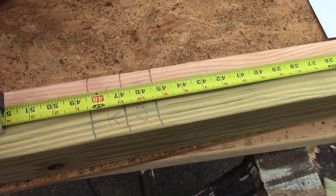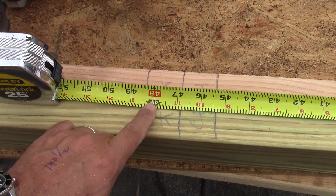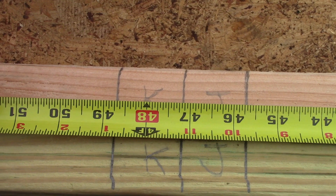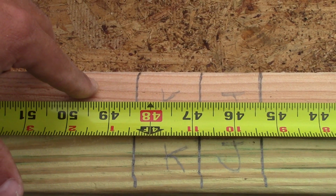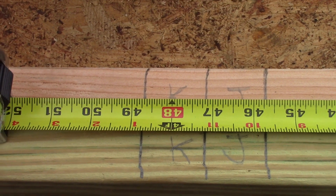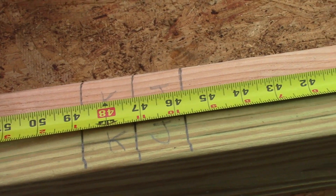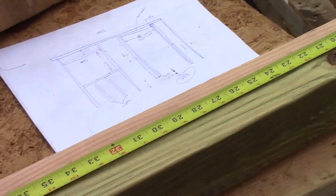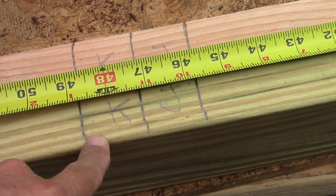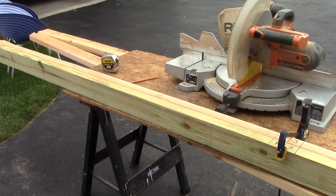Now I need to make sure we have studs on every 16 inches. I noticed that the 48-inch mark falls on the king stud but isn't centered - it would be better if it were. Rather than adding another stud, I'm going to move the doorway over about three-eighths of an inch. That'll save a stud and is really the way I should have done it to begin with - a little mistake to correct. I'll go through and fix everything with a marker using a different color.